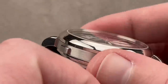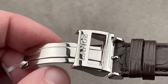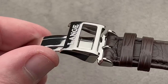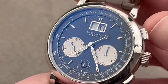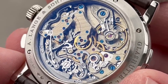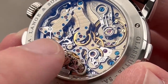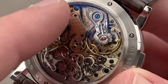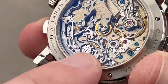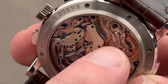You can see this platinum case imposing in its scope, and equipped with an optional extra rarely seen on the Datograph — a full matching deployant clasp in platinum. This watch comes with a pin buckle, so someone opted to upgrade with this clasp, and the next owner will be the beneficiary. This is Caliber L951.6, the sixth revision of the movement that originally debuted in '99. You can see the combination of the column wheel and lateral clutch, jewels set in golden chatons fixed into bridges by blued screws. We have both black-polished and fire-blued screws. The golden parts of the movement are nickel, copper, and zinc — the copper giving them the golden hue. That's the material known as German silver.